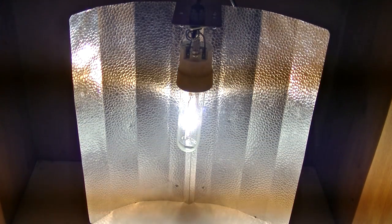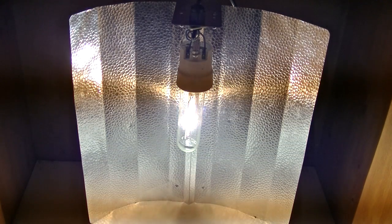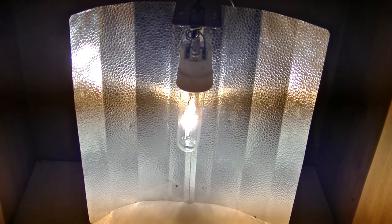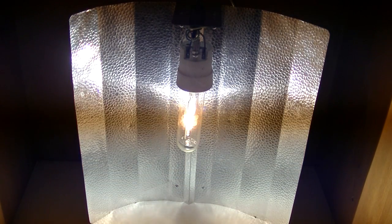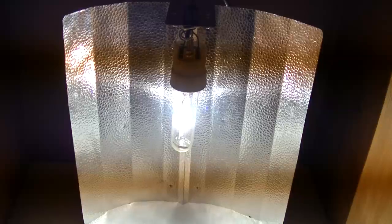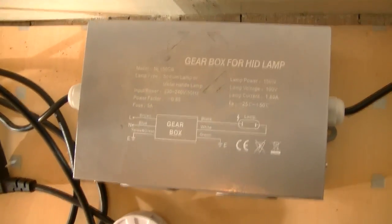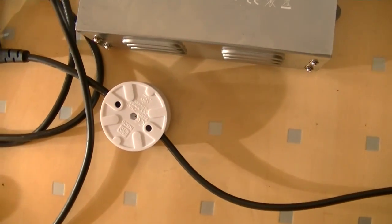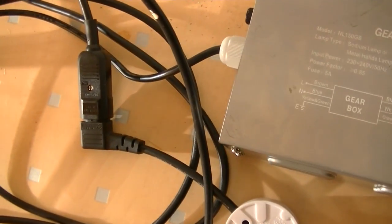You can either choose HIDs or CFLs. CFLs will run a lot cooler than the HID lamps. The choice is yours but I will give links in the description to all the product details so you can make your own choices. I'll come down and show you the ballast — we're running this off basically just a shop lighting ballast. I bought this off eBay for about £15, a pretty good price. You had to wire it yourself but it's just as simple as live, neutral, earth wiring and an IEC connector to connect it up.